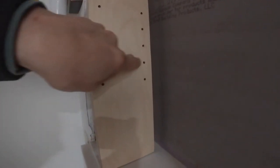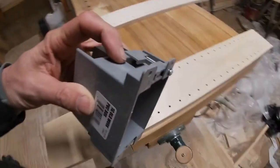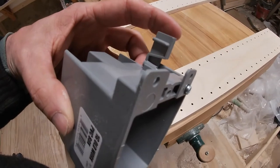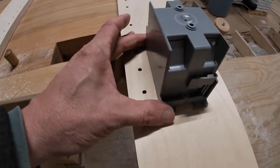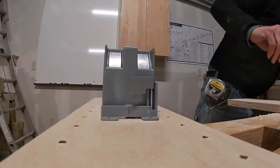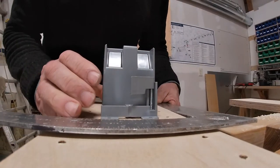And this outlet over here. So right here we're gonna have to cut in an outlet box. So that's what's next. Okay, we've got our little remodel box with these little ears. That's gonna work nice. So just gonna lay this box about where I want it, and a little square here. Make sure we're square.